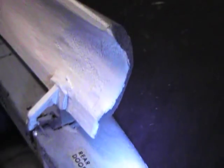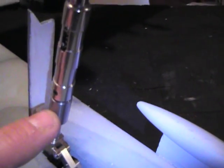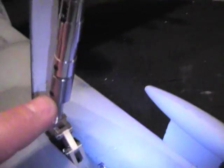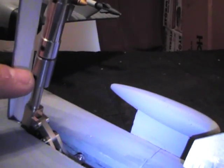Kind of oil these up a little bit because the insides of the doors are white. It's a balsa door. Took a little piece of Depron foam, put on here to finish out where I had to cut out, because with the nose extension that we have put on these, this piece right here, in order to bring that plane up level when it's sitting on the gear so it doesn't have a negative angle of attack. This is probably the most sophisticated part of this DSR mod. You really do need this piece right here, which is 15 millimeters, to extend the nose gear up high enough when it sits down level, so the plane will sit level with the ground.